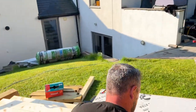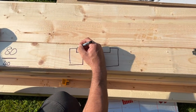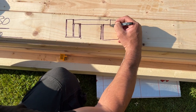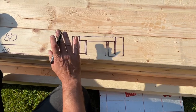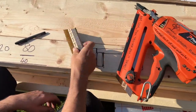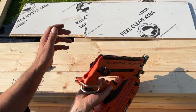The way we're going to build this wall — we'll have a double timber on the front, a shorter timber, a taller timber, then another timber — same again on the other side. So we'll have a double stud each side and the steel will sit nicely on there. We're going to nail it with the IM350 using aftermarket Biper nails — 90mm smooth shank, because the ribbed ones don't fire well in the Paslode.